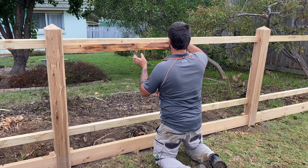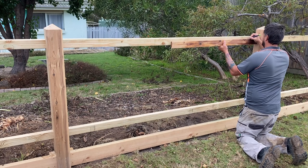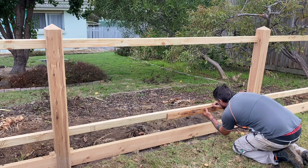If you can get a piece of timber that's the same width as your fence bay, that's great. But if not, just mark up to where you can, then line up your end with your last mark and continue on. Now you can repeat the process on all the other rails and all the other bays that are of the same distance. As you can see, this makes the process super quick and easy — just another great reason to try and get your post spacing even.